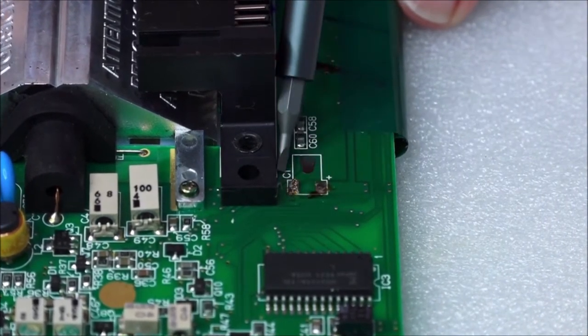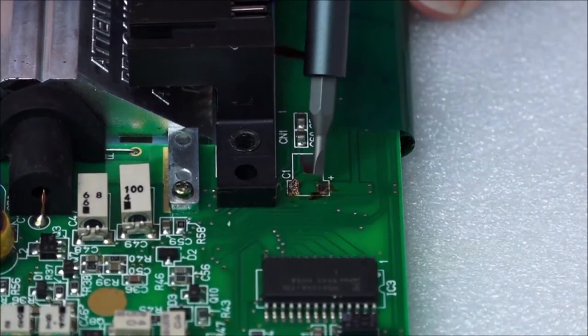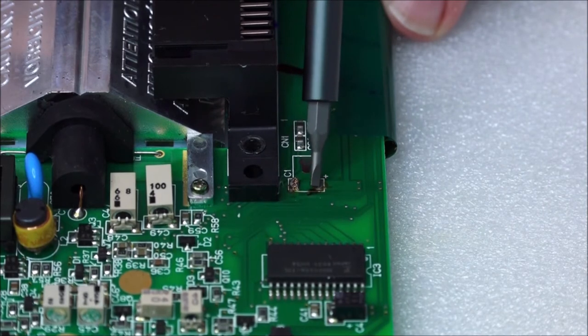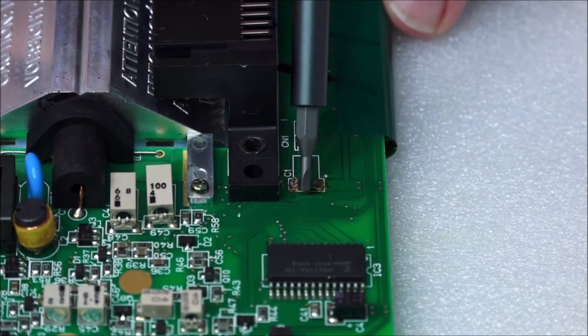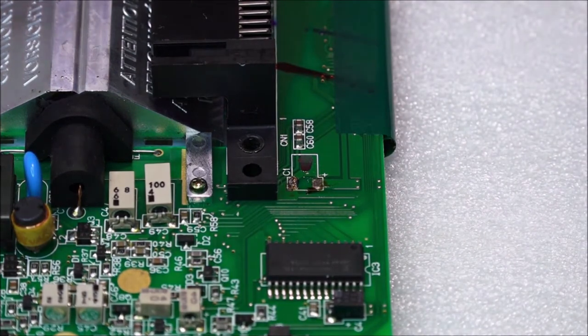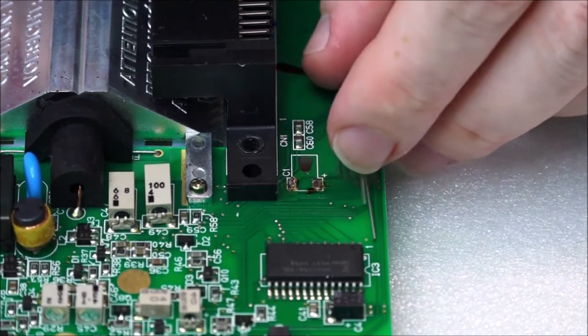And there's like a little box here. Hopefully you can see that. This white box. The capacitor shouldn't go any further than that. So we really want to keep the legs as short as possible, soldered up, and then we want to bend them into sort of an arc so it lays nicely across. So we're just going to try and do that now. Let's measure up.